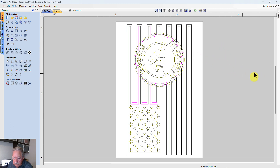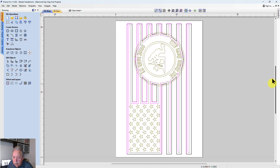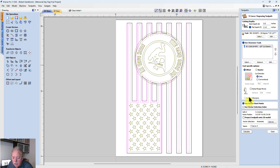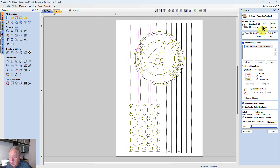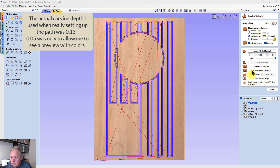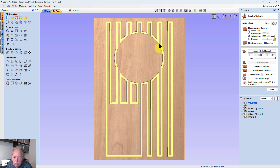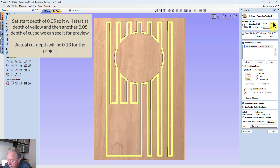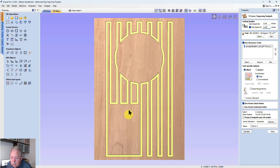I'm going to show you how I did the actual tool pass — it looks kind of messy here but you'll see in a second. The first thing I did was a preview to make sure it would work. I'll open the tool pass and do a clear pass — I'm marking this as 'CL' for clear — with a depth of 0.05 for now. After calculating and previewing the clear path, I set up the black epoxy toolpath, starting at 0.05 and going down another 0.05. I'm using a 30-degree V-bit and a quarter-inch end mill to do the hogging, since the black pour covers a large area.